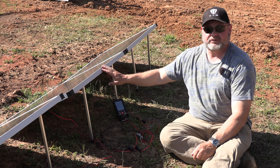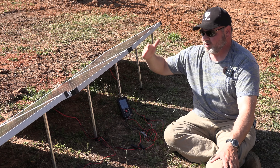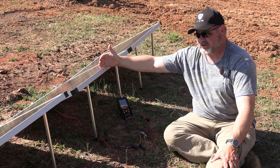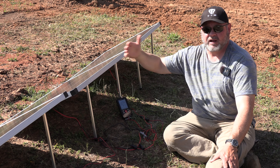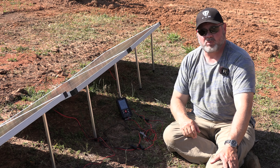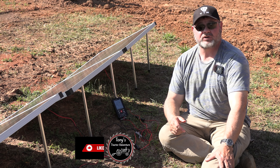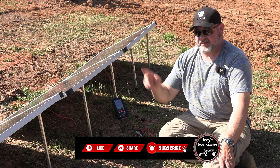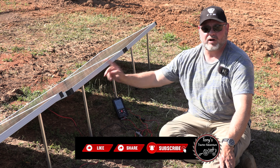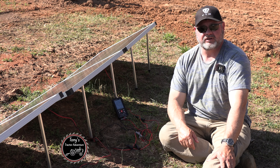If you're interested, follow us on our build. We're putting out a video on the complete solar build. We'll have four sets of three panels, so series and parallel combined for maximum wattage — the system will eventually take in 1,400 watts. I think this is going to be a perfect match. And I hope this answered the question: with Harbor Freight panels, yes, you can run them in series.